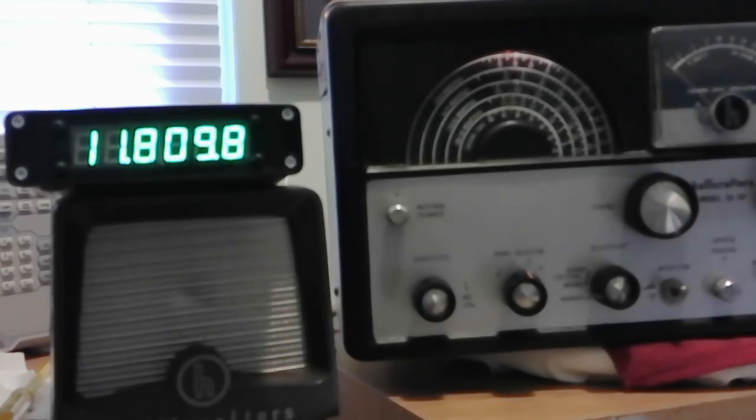I've got it back together and tweaked a little bit on the RF with the signal generator. Made a small improvement there on bands 3 and 4. And clearly the 10,000 picofarad mica in the oscillator circuit is resulting in considerably less drift than the typical poly capacitor or orange drop people would put in. It still drifts quite a bit, but a whole lot less than any others. So lessons learned, just a simple 47 picofarad pickup off the cathode to the mixer tube goes straight to these little Chinese frequency counters very nicely, and we get a nice signal